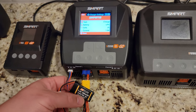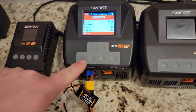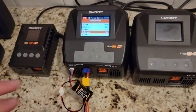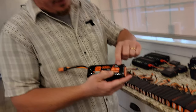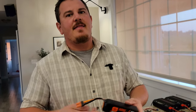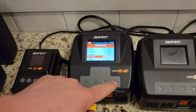Since this isn't a smart battery, you have to go ahead and tell it what it's going to charge at. It's already set to 1 amp. This is actually a 380 milliamp hour, so if we were charging at 1 amp, you'd be charging at almost 3C — because 3C would be 380 times 3, which is about 1 amp. This is a 5C battery, and what that means is it's designed for a slower discharge. So if you charge at 3C and it's a 5C pack, that's sort of a strange thing. These other batteries are 30C — 30C speaks to the discharge, how fast you consume the power. The charge rate, also called the C rate, speaks to how fast you can charge it. So how fast you can charge or discharge are two different numbers.